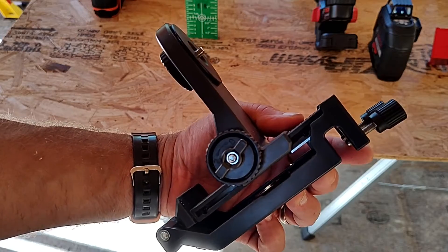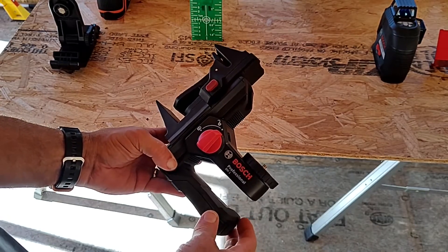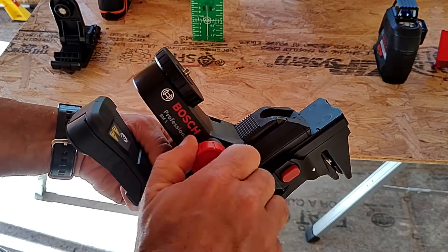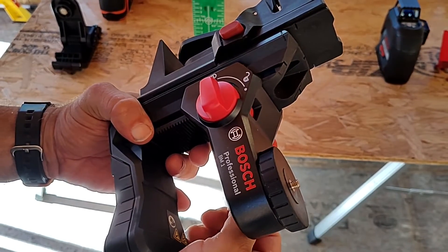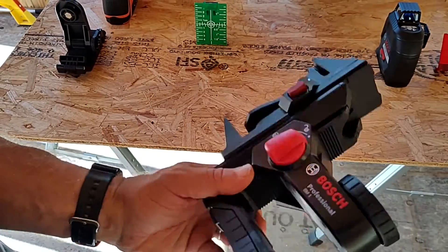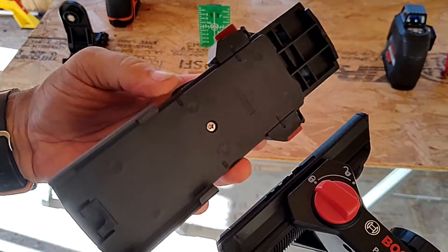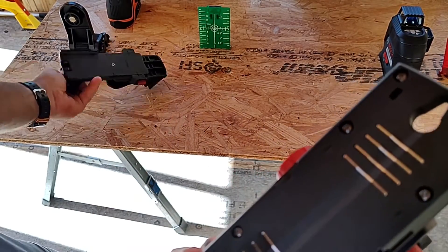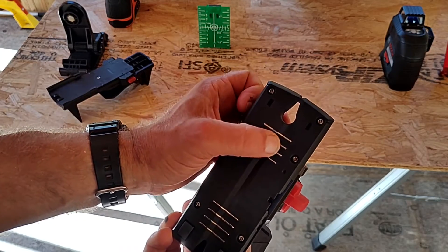The Dovo stand is a little bit lighter and a little bit less stable than the Bosch stand. You can see the Bosch stand is just a little bit meatier — easily twice or maybe three times the weight of the other stand, and obviously more durable. The locking mechanism for travel going up and down is a bit more secure, and it's engineered just a little bit better, which speaks to the higher cost of the tool. However, in order to take advantage of the magnets on the Bosch, you have to take the other piece off entirely, which means you have to keep track of it — a little inconvenient.